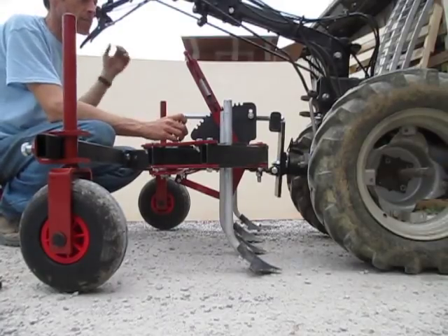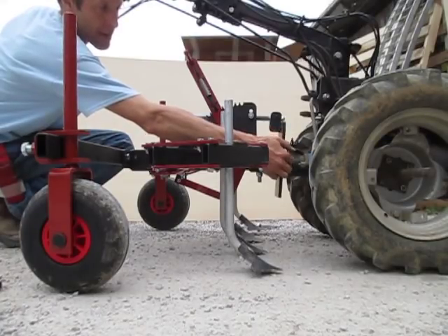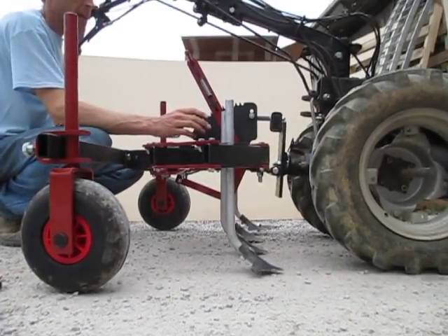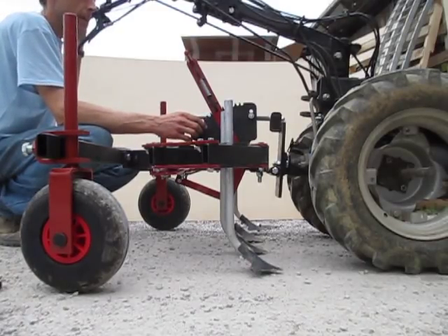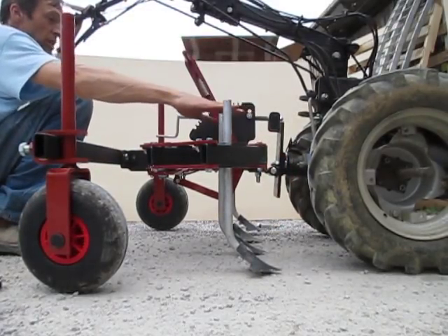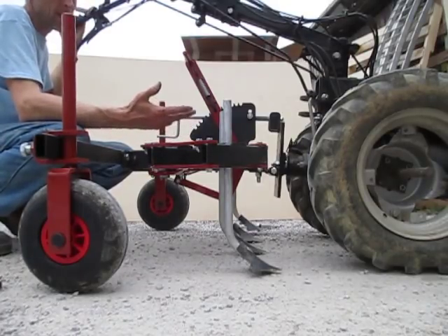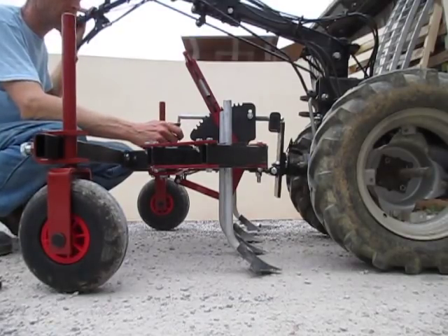The quick coupling flange attaching to the tractor is adjustable in many different height positions — there are about seven positions total. You can raise and lower this depending on the height of your tractor wheels and whether you're straddling raised beds or not. If you're straddling raised beds that are really tall, we have an extension plate that goes in the bottom of this to allow the tractor to be lower. You've got to watch for ground clearance under the tractor — if your tractor only has seven or eight inches of ground clearance over a six-inch tall bed, you'll only be able to straddle plants that are one or two inches tall.